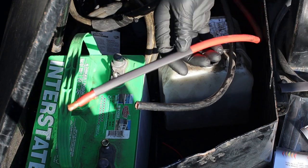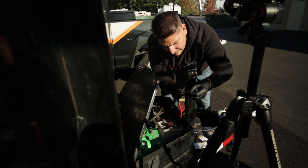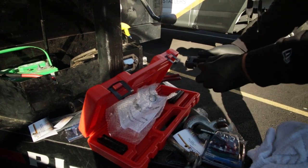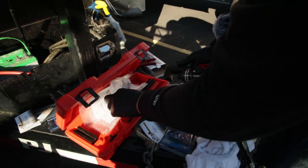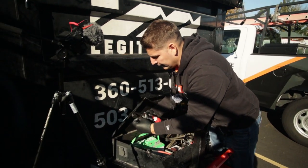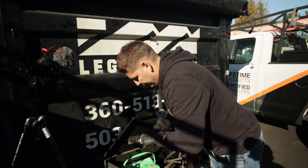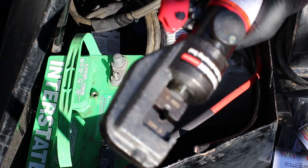I'm going to show you guys how to do this — we're going to crimp it. We take out this hydraulic crimper, which has dies. You put the dies in — this is seven gauge right now — swap to four gauge, which matches our wire. You put the four-gauge connector on the bottom, put the die on top, it locks into place, push it on, and the hydraulic starts moving up — that is super cool.